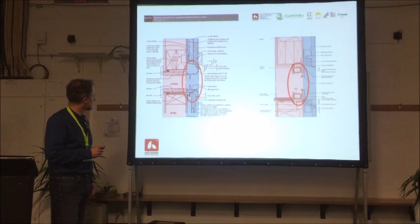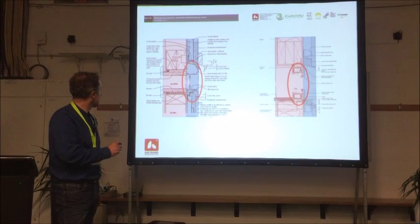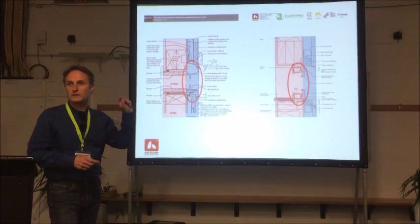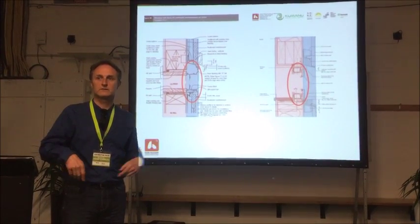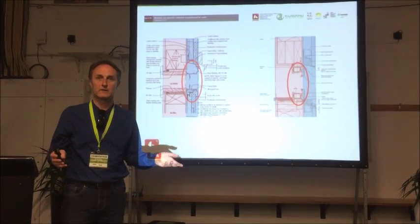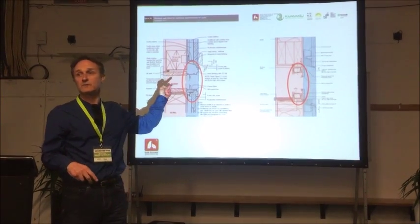If you look closely at an aluminium window, there's a drainage channel at the bottom — the little graveyard for dead flies and the place where mould gathers. That's because the window will have condensation, which occurs where the cold meets the warm, and that glass is exactly where the cold meets the warm. If you look at that channel at the bottom, there are holes drilled in it for condensation to drain outside. You've got to think about everything together — you could do thicker insulation in your roof, thicker walls, a fully insulated slab, but if you don't do your windows properly, there's a hole in the bucket.